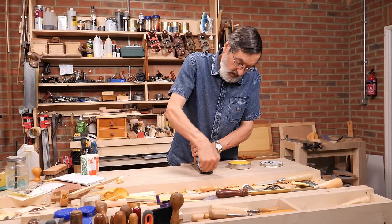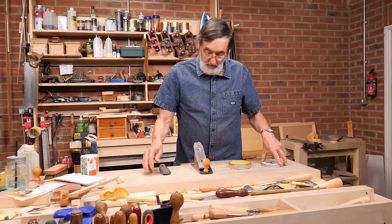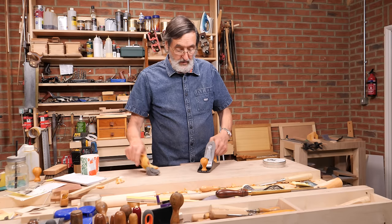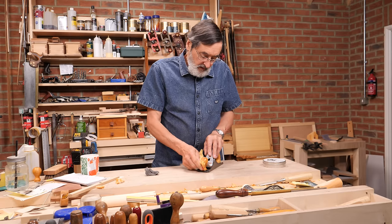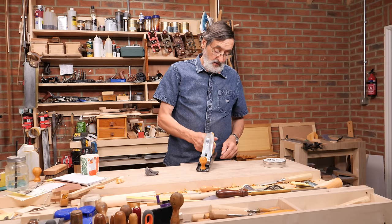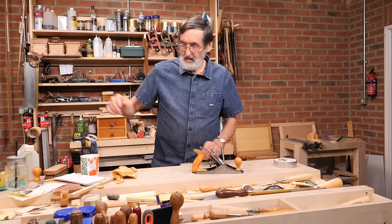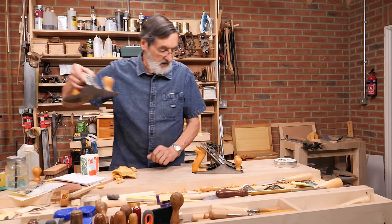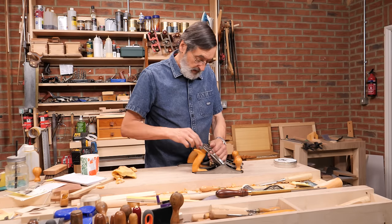I've applied it with the steel wool because that just seems to apply exactly the right amount. And that's basically it. Then you can buff it with a soft cloth or a shoe shine brush or whatever. And the end result is a very lovely handle and a plane that's just transformed. You've customised it, I've customised it, we've got new totes on, and I've got three of my planes set up that way with new handles, and I'm really happy.